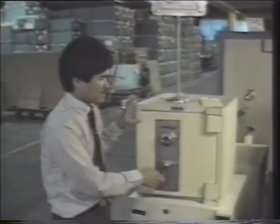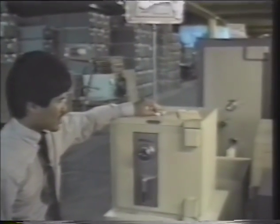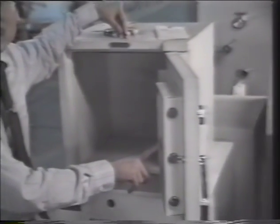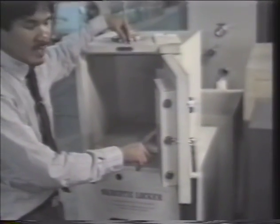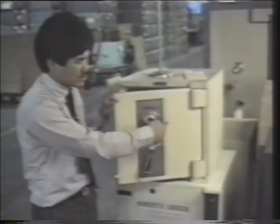To attack this safe, one only needs a good, strong, heavy-duty drill, where one would drill through the top, entry to the door, here, into the wheel pack, and from there you would read the wheel packs. You would have your own combination. Thus, you avoid all the hard plate and protection on the front door.